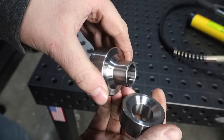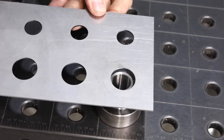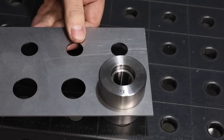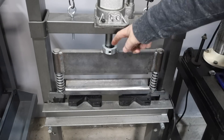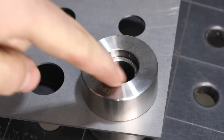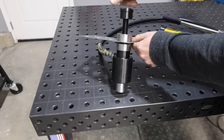To make these dimples you use a dimple die, and if you haven't seen these before, they have two pieces that fit together like this and just squish the material down. You put your hole over the top, put the other piece together and press on it, but you have to press with enough force to actually form the dimple. That's the problem with the shop press I have, because on the sides I can't fit a long panel in, so I end up using the hole in the middle with a punch driver like this.